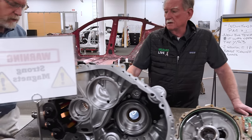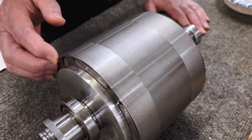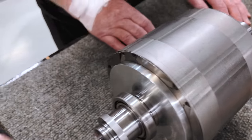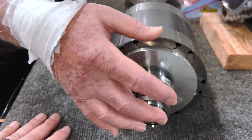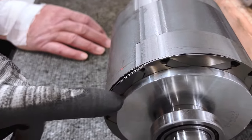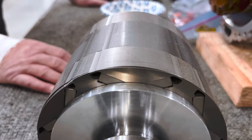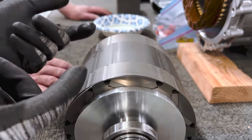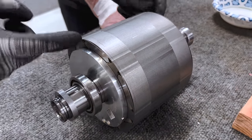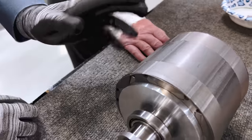Let's go back to the PM rotor. You can see this is a little different than anything we've ever seen before. First off, the keeper doesn't go all the way up to the full diameter, which is fine from a weight standpoint, but we're a little worried about this. One of the functions of this aluminum end plate is to help retain the laminations. With the end plate not coming out to the full outside diameter, they've exposed the magnets, which means the laminations are not supported all the way to the OD.